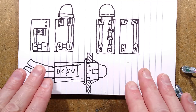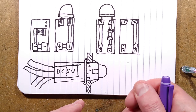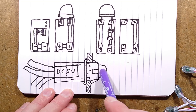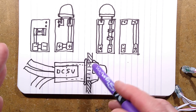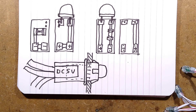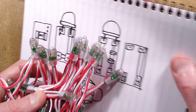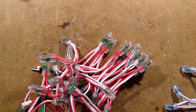If the hole is too big there's a risk the pixel will pop through or fall out, and if it's too tight it will put a lot of stress on the connection between the plastic and the LED, so it's worth experimenting. Colour-wise, you buy them by the string in the colour you want: red, yellow, green, blue, and white.